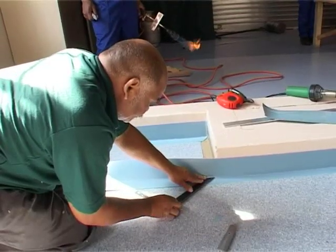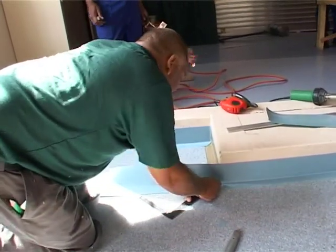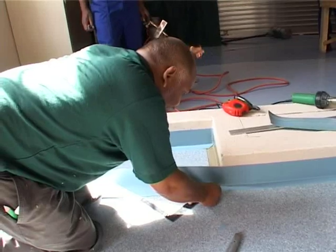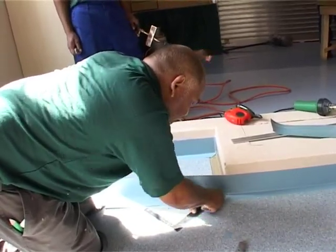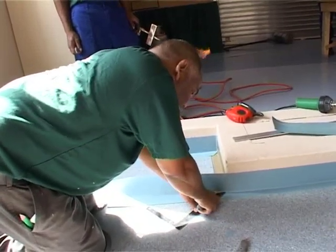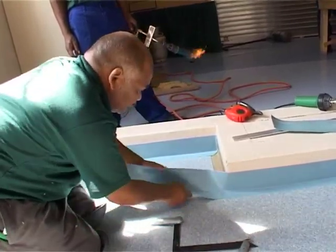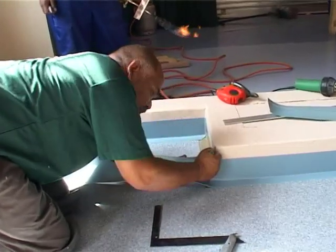On the external corner, the triangular gusset needs to be cut, and similarly a piece of skirting carefully fitted to close the gap that would be left when taking the skirting around an external corner. Again, this should be carefully fitted to just over the mark on the wall, giving you a tight, strong corner for your skirting.